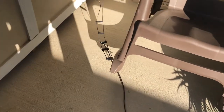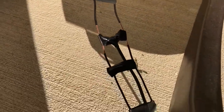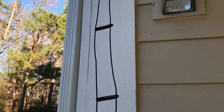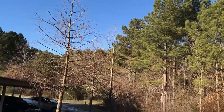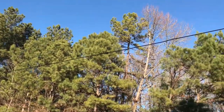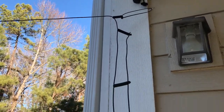The antenna is right here. We put the feed point at just about six inches up and made our own open wire feeder with some black rubber hose. It goes right up to here and shoots right over to that tree. You can't see the yellow wire — it's a half-wave length on 27.385 MHz and matches up really good.